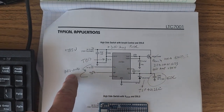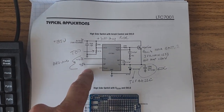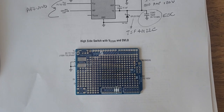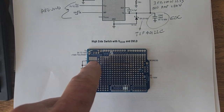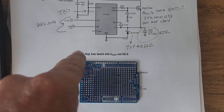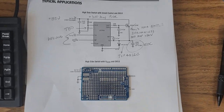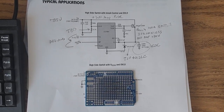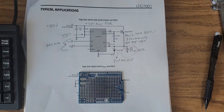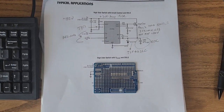With this thing I don't need a separate soft start. The controls come from an Arduino — probably an Uno — which will drive these lines. This part will fit on a little board, the discretes will go in there, and the five FETs in TO-220 packages will mount up against the heat sink. That would give me a pretty robust way of having the Arduino control this stuff. I'm also going to put a big fuse in here somewhere, just in case someone shorts the thing.